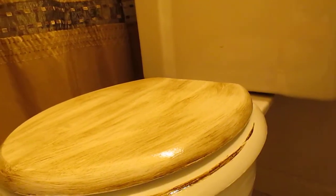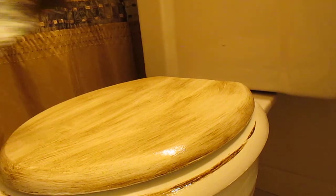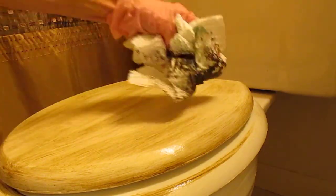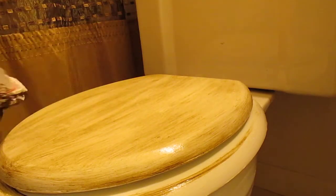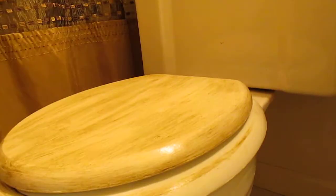Actually, if you find that you've got either not enough on or too much on and it's dry, if you put some wet stain on and wipe it again, it will actually be able to take more of it off. It's like it wets the whole thing even after it's already been sort of dried. So there's lots of chances to get it right if you mess it up.